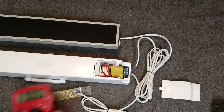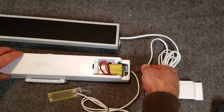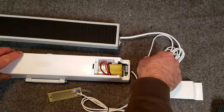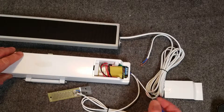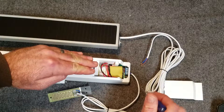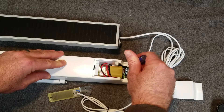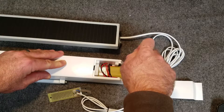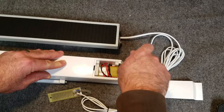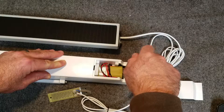You also want to check to make sure that these wires will not pull out — as you see I just demonstrated. I didn't get full clamping in there and I expected that. To fix that: what's going on in here is we've got these set screws pushing down a tab, and the tab keeps the wires clamped in there. What we want to do is make sure that tab fully pops up after I back out these set screws.